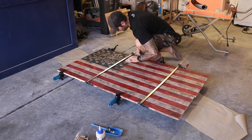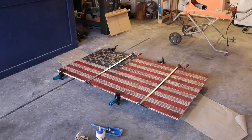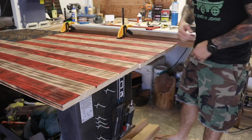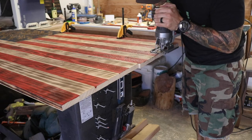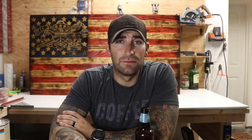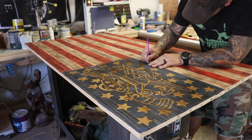There was about a quarter-inch overhang because I measured poorly, so I'm squaring it up with a jigsaw to make it look like one solid piece. You could also use a circular saw or handsaw for that trim. Then I'm just erasing the pencil marks.